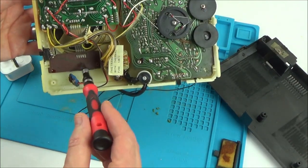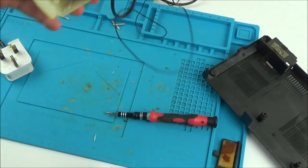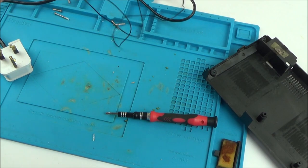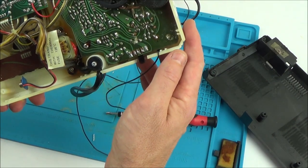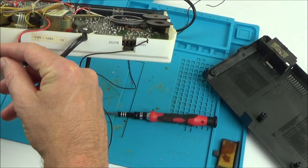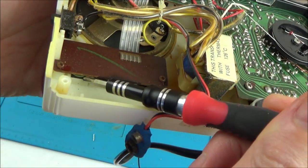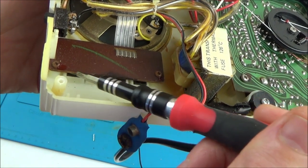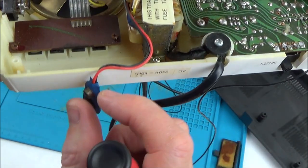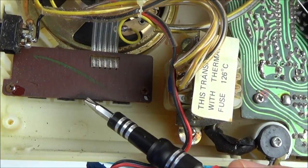So we're dealing with the ones here — we don't really have to get too involved in it. I can still hear it all rattling inside. Before I even take that off, if you have a look under here — can you see there's like a green pad there? I think there must be some plastic pads under here going onto the contacts, and it looks like all of them have broken. In fact it looks like something's burnt here, or maybe dampness or water got spilt on it.